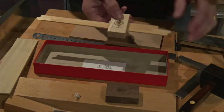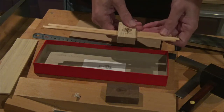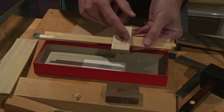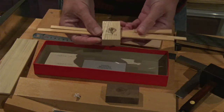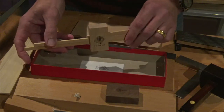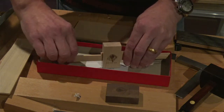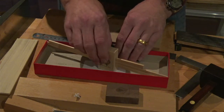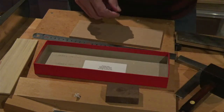So what I made on Monday, and what everybody missed, was this pair of pinch sticks, which are locking with this little wedge in the top here. So basically we've got a hardwood block, a couple of arms that can be extended either way, and then a wedge to lock everything when we've got our diagonals fixed. So adjust the rods to fit the diagonal, lock it, and then you can test the other diagonal and any other things that are supposed to be the same size. So that's what we're going to be making.